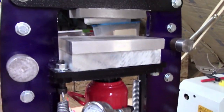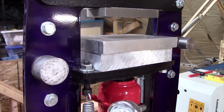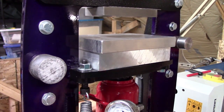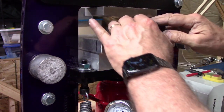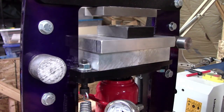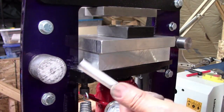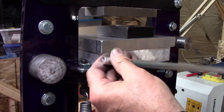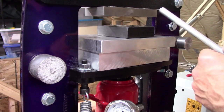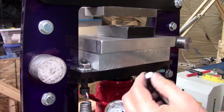So let me set this up so that you can maybe see, and then I'll set this up and press it. What I do is I have a block of urethane that is part of a larger block that I had and cut, and I use a long rod typically. This is just aluminum, use whatever you think works. Given the small size of that setting cross piece, I'm going to use a relatively small, about a half inch rod